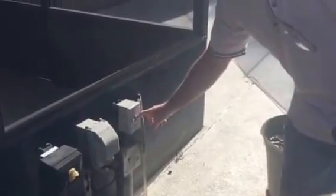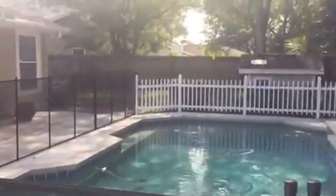This is a pool light, right here. Now that pool light is on a ground fault receptacle — a GFI outlet located right by the equipment. If that light won't come on, check that outlet and reset it. If it doesn't reset, it's usually a bad GFI. Right now his is fine — the breaker works, the GFI works, the light works.